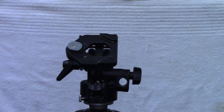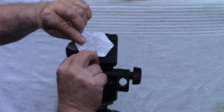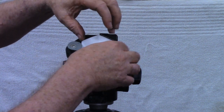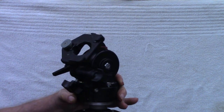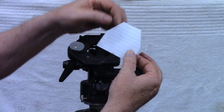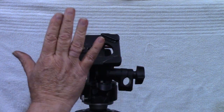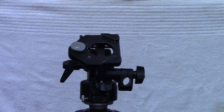I could go ahead and make the full hexagon — a hexagon would fit in there and could be turned six different positions. However, I never really saw the benefit of that when all you've got to do is rotate the camera or rotate the tripod. So what we're going to make today is just three sides of the hexagon. This lever will pull back, you push the shoe in, it pushes down a little pin, and when you push that pin down, it locks into place.